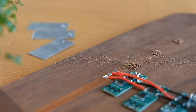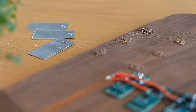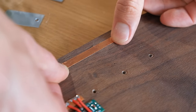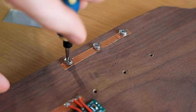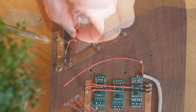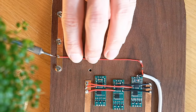Before mounting the aluminium tabs in place, we can drill another three holes near the edge, which this time can be joined together with a strip of copper tape and capped off with three small screws. These small screws will form electrical contact points for the infrared receiver's signal wire, which can at this point be soldered to the copper tape.